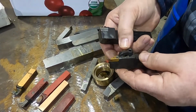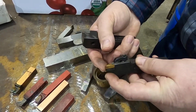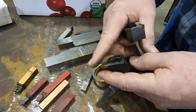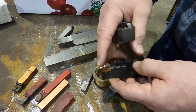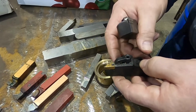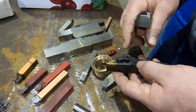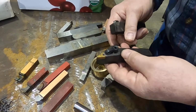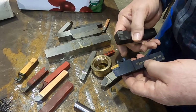But I do understand their point: clamping at the back can raise the front a little bit if there's some micro imperfection in the surface there, and now we've got some movement on the tip, as opposed to just letting the cutting force drive it down and hold it in a consistent place. I go with clamping. I like clamping. In fact, I would much rather use clamping than any of the pins, and I usually use both just because it's there.